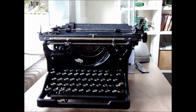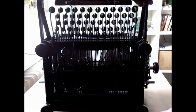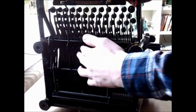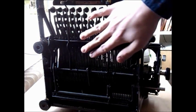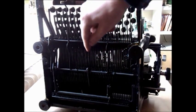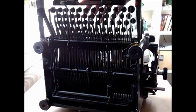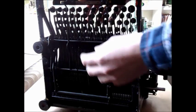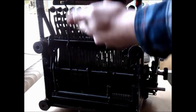Basically, the way this works is through electrical contact. When we flip the typewriter onto its neck, you're going to see all the types are nicely laid out down here, and this is where the circuit board would be mounted. There are lots of gold-plated contacts on the circuit board. Each time you strike a key, that creates an electrical circuit, and the board then tells the computer which circuit has been closed, and thereby which key has been pushed.